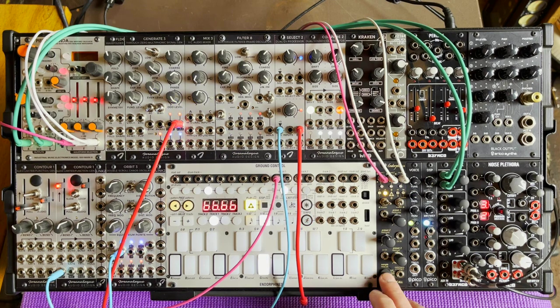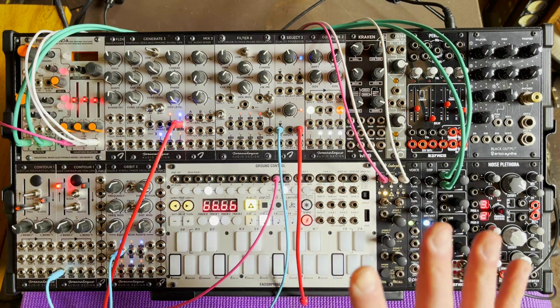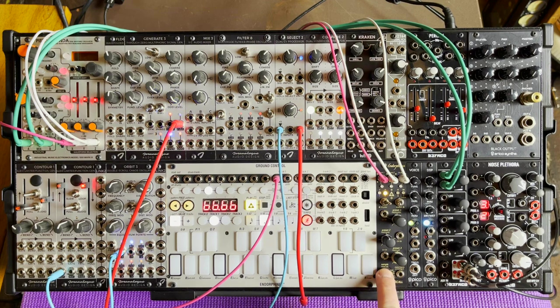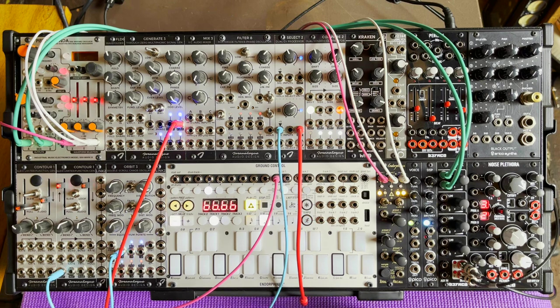The way to enter mode 2 is to hold the macro or sample button long enough to see the preset LEDs blink once, right? Now be careful, only once, because if you hold it too long, you will get a second blink of the LEDs, which will get you to the macro modes, right? So right now we don't want that. Let's just hold it, and as they blink, now we're on mode 2 of the preset manager.